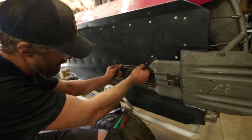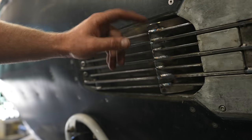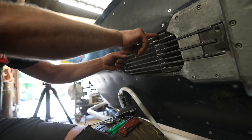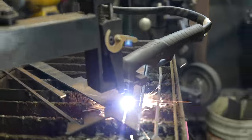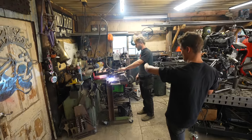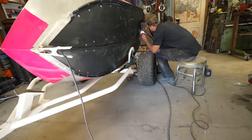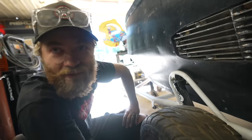And I'm gonna make these other two side pieces here. There's really no water going in on the outside of that, but if I leave that gap open, right here is easily big enough to suck in a rock that would jam up the jet. So if I put this here, weld it onto the outside of that fin thing, and then put another little tab here like this, that'll make it more rock resistant. Wow, that this intake is much greater than it was before.